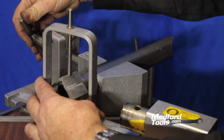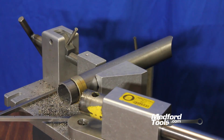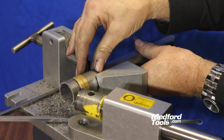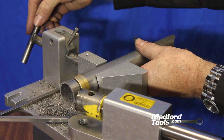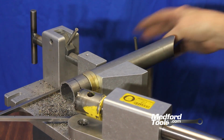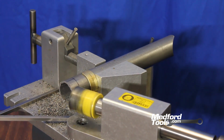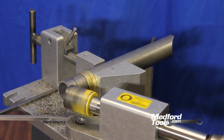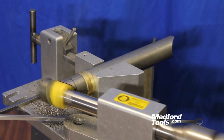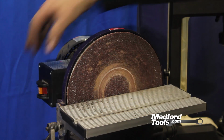And now that we have our tube clocked, we can remove our flat stock and our centerline finder and push the arbor up to minimize chatter. And if we have our tubing and our hole saw aligned with the teeth at our mark that we've made, then we will have a clean notch. Confirmation once again of a good notch. The backside was slightly notched.